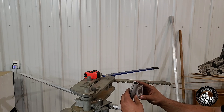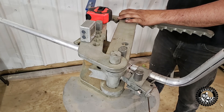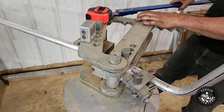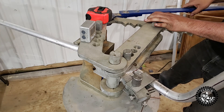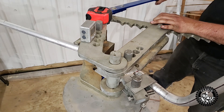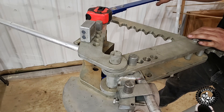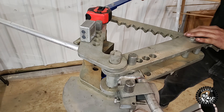Put the angle gauge on there, make sure she's straight up and down, and this one here gets bent 50 degrees. You have to remember when you're building this that there's a left and a right side — right now we're building one of them. The other one's going to have to be built opposite, so this bend will have to go down. To get 50 degrees, we go to 52 and slack off — stops at 50. So there's two degrees of rebound basically.